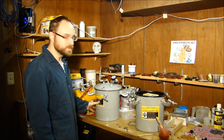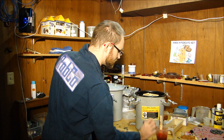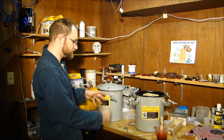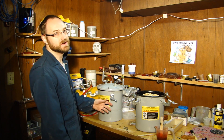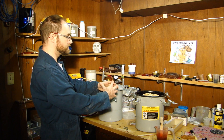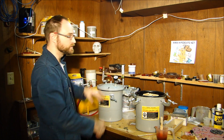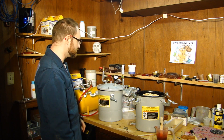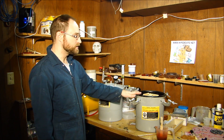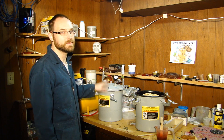The reason I have two pots is because liquid rubber — that's what I've got mixed up here — takes longer to cure. I generally like to keep it pressurized for eight to twelve hours, just so it stays in that pressurized environment in case there are trapped air bubbles. If it's not fully cured and you let the air pressure out, that compressed air expands and gets trapped in the rubber, giving you weird warped distorted molds. So I keep one pot for rubber and one for resin casting, so I can pour three or four molds and still be popping out resin cast parts in the second pot during the 12 hours the rubber is curing.